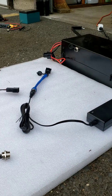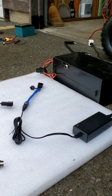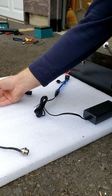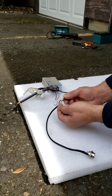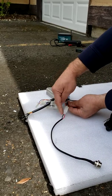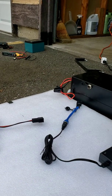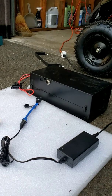I hope this was a helpful video on how to do detailed charging and battery testing — including how to handle a charging port not passing power, how to test if the controller is passing power, and how to test your batteries. Remember: if you ever replaced this charging port and it came without the plastic plug so you inserted the two wires yourself, check that the wires are not crossed. The black wire has to be aligned with black and the red with red. If you cross those two wires, your charger will never switch from green to red. I hope you fix it after watching this video — thank you, bye.